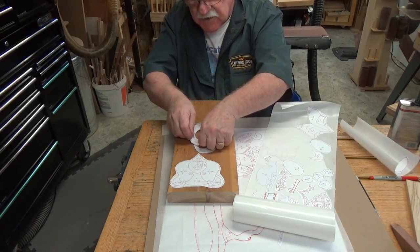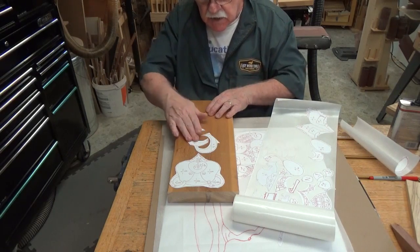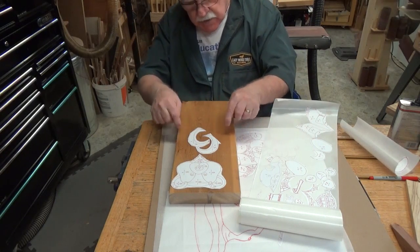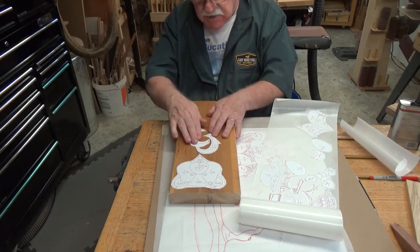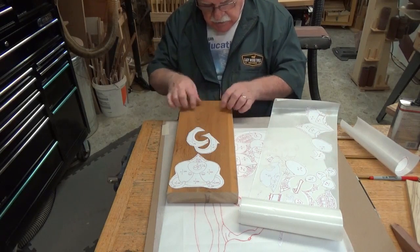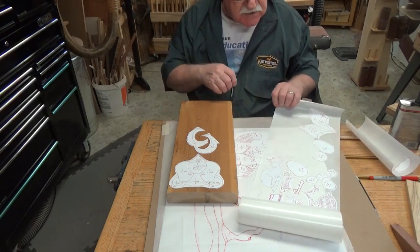Western cedar is a very soft wood, and it chips very easily, it breaks very easily, so it's something we have to treat with care, and if we stay away from these tight grains, then it doesn't want to break as much.